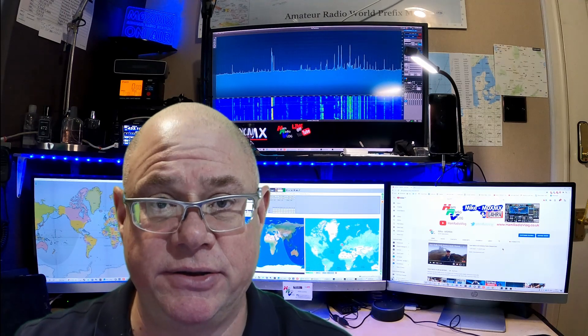There's been a lot of interest in this subject since the last video I made. What this box enables me to do is use any of my old 2-meter and 70-centimeter handhelds and talk via RF to the box. The Micronode is on the AllStar network and connects to various other networks such as EchoLink and HubNet, as well as individual talk groups. If a friend has EchoLink on his mobile phone, I can dial his node and other people can join in.